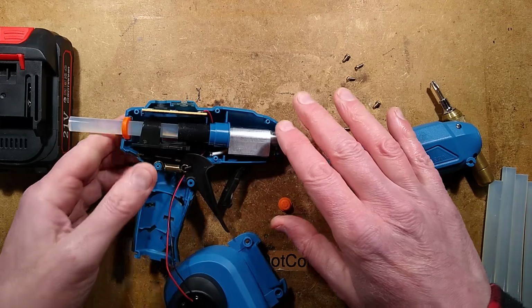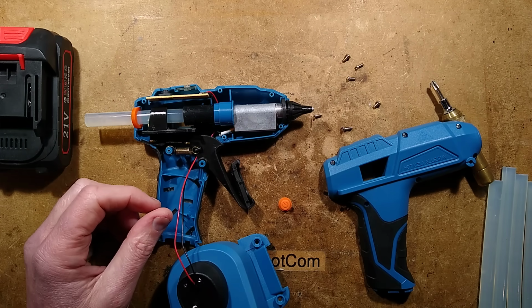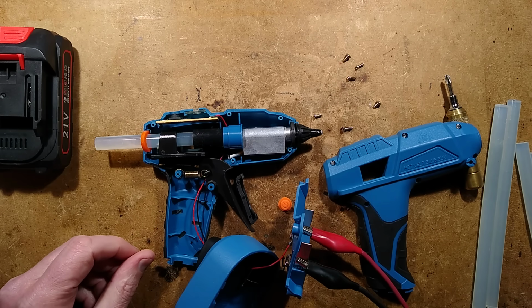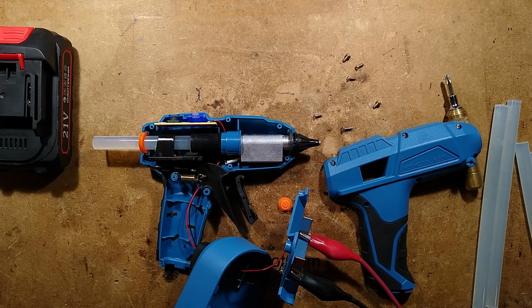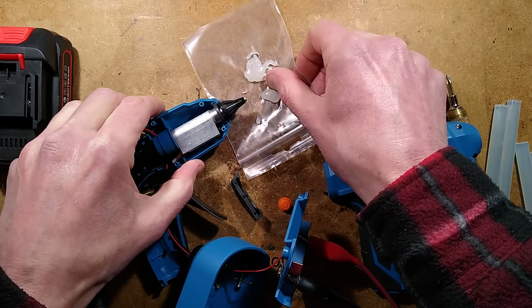Okay, right, tell you what, I'll just hook this up and be back in a moment. Okay, it is hooked up and I'm going to turn it on. It's set to 20 volts. Maximum current in this power supply is 3 amps. And click the switch. 2.4 amps. Oh, it's gone up to 3. And it's now going back down now that it's actually starting to regulate the current with the PTC heater.